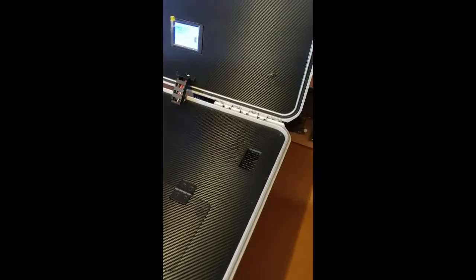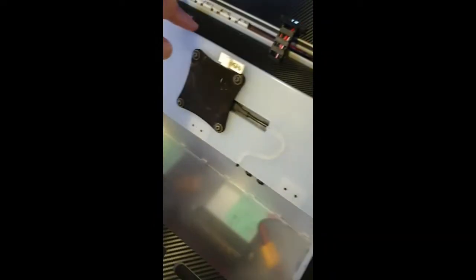So this will be quite nice. It's going to be really nice. The storage as well, that's been created. That was from a box section. I've created a box with locating tabs. You can just about see the locating tabs. Again, the laser is perfect for this sort of thing. So I've created the locating tabs, and then created the box and used acrylic welding cement to cement the joints in, and that literally just melts and fuses the acrylic together. So that's held in.